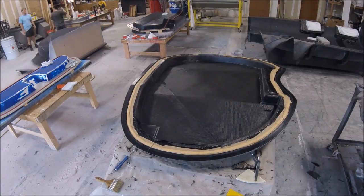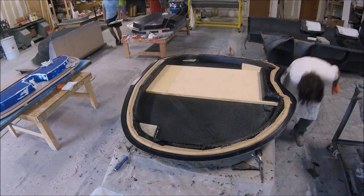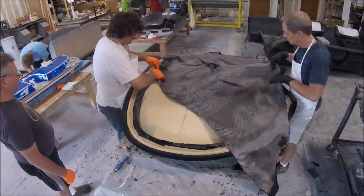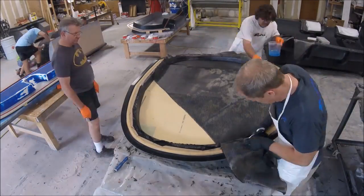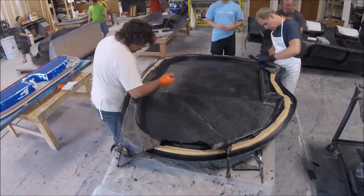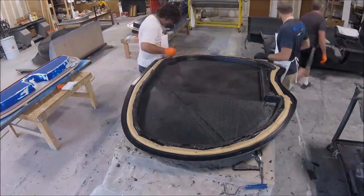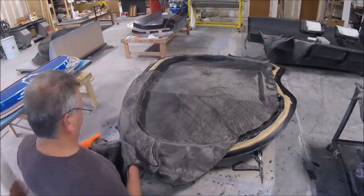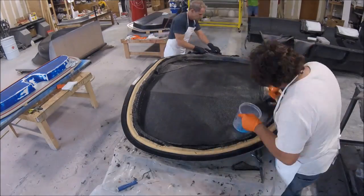The next thing is for the core to be laid in place. Here you can see the various pieces being put in - they ended up fitting fairly snug and we had to do a little trim work just because of how tight it was, but they went in nicely. You can see the hard points for the landing gear went in the bottom left corner there - the green FR4. Then two more layers of heavy carbon fiber fabric go in, everything wet down, trimmed off and smoothed out, and then we put it under the vacuum bag. There's the second layer going down getting trimmed off.